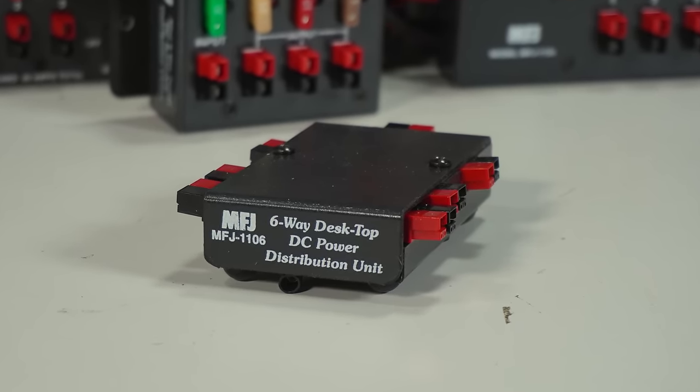And the advantage of this, and one of the reasons why I wanted to go with this, so I snipped the line in the back of the Andersons plug for the distribution bar, put an Andersons on the Andersons plug. That Andersons plug still has the fully elongated cable, the stock cable, and I can untie that. Basically, I have it wire wrapped with some Velcro. I can untie that and I can connect it to a solar panel system. So I can go straight from a charge controller into the DC output of the Andersons, plug my shack while still charging my batteries if I were to ever need that.